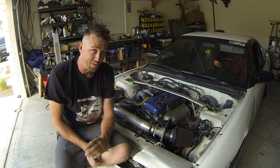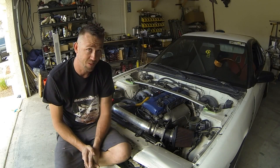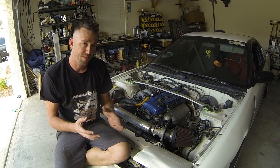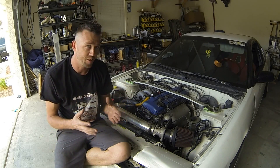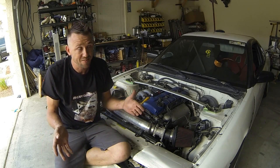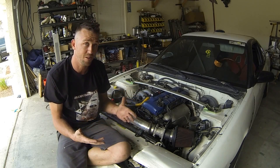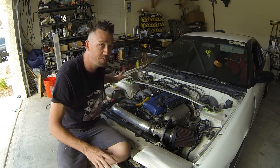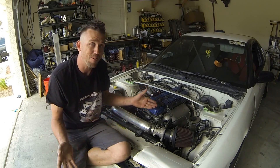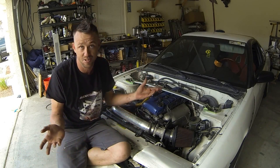It's time for you to play executive. Should you or should you not proceed with this build? Think about it for a second. What are some of the problems when a car gets into a collision? Frame damage is the main one. Your main chassis rails or main structural components — if they're crooked, it doesn't matter how many tubes you throw in here. You'd just be throwing them onto a crooked chassis, and that's not worth it. A crooked chassis is not going to go racing down the block.